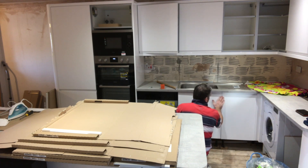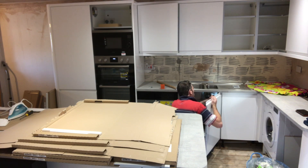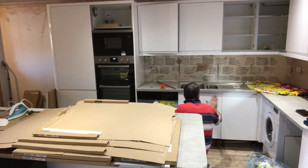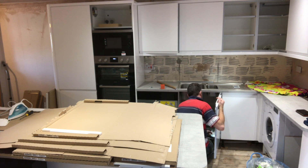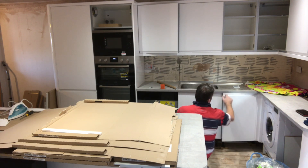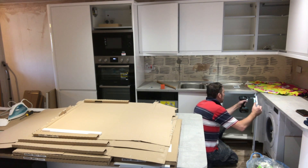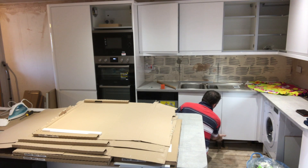I always have a feel at the top and bottom — if you've got a lip there, just get in your inch and just move your door back out. Right until you get it right, make sure it's right, and then move your next leg back. The top one — once you start screwing the top one in, it pulls it back like that, and then you want them bang level like that.